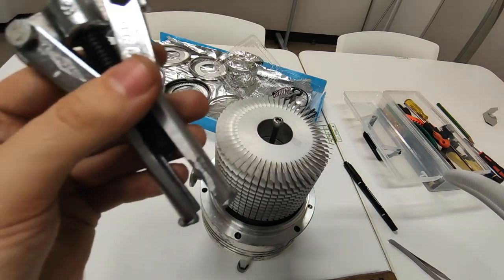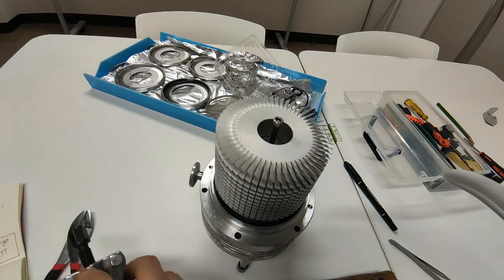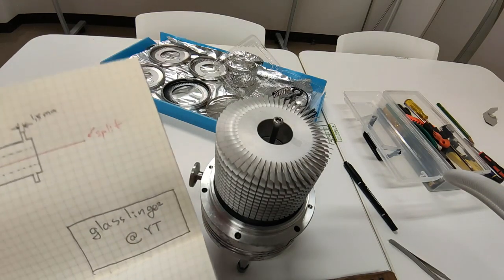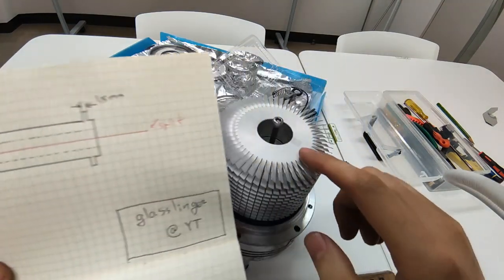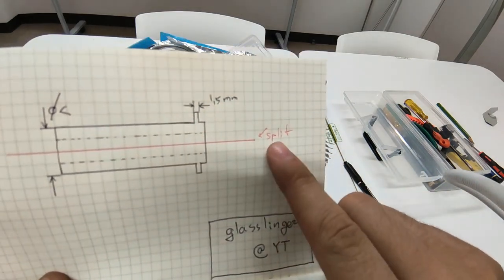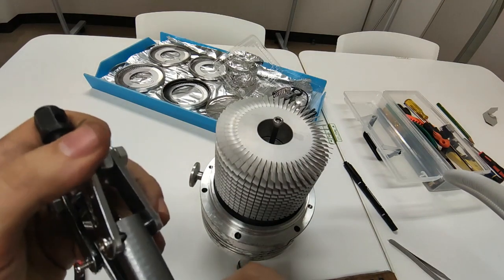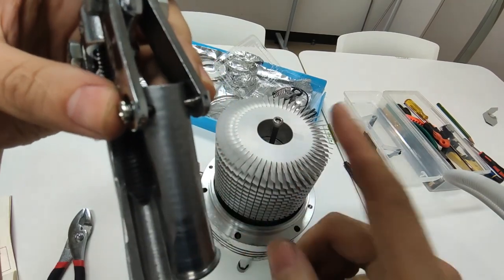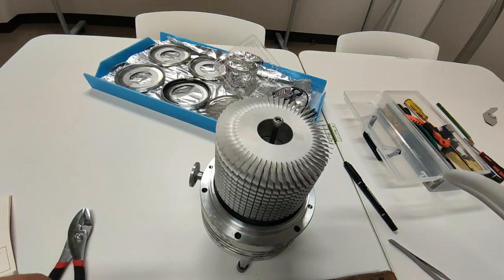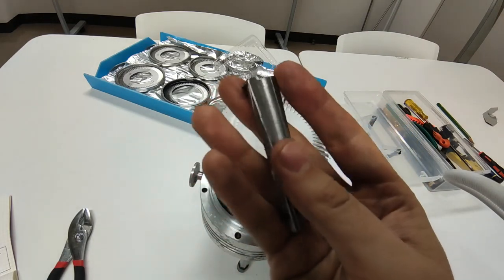I sort of wanted to repeat that, but first I didn't have the materials, and second I wanted this puller to be multi-purpose for other pumps as well. So what I did was take a large steel bolt, machine everything off so it's essentially a tube, drill it inside — the diameter has to be smaller than the hole diameter — then split it with a grinder, and grind everything to shape. I didn't have time to find good nuts and bolts, so it's just roughly attached. It's fine since it's not strongly pressed on.